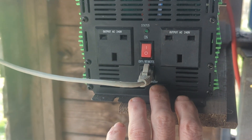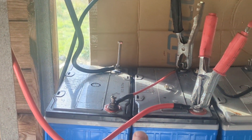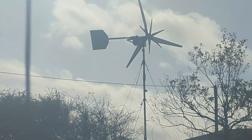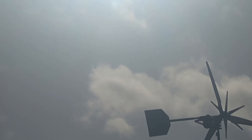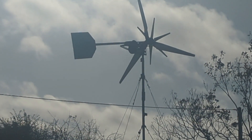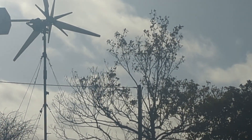There's something going on with one of the batteries. The inverter still appears to work, and if it's mega windy we'll set the batteries up at 24 volts, plug in via the rectifier and have two 400 watt lights plugged in to suck all the juice out of the turbine. Not sure how well it's going to run, but it's definitely going to run like hell on the Thursday. The wind's saying about 9 to 10 mile an hour now so we'll just have to wait and see.